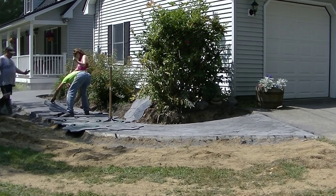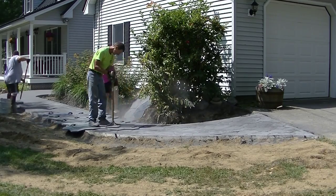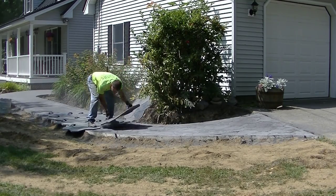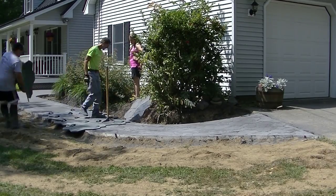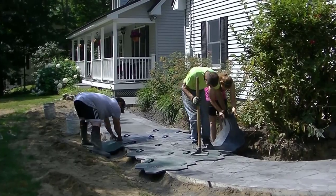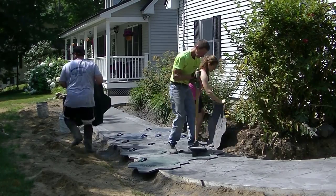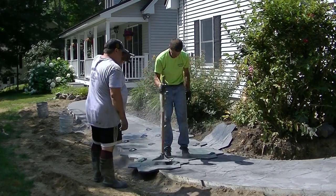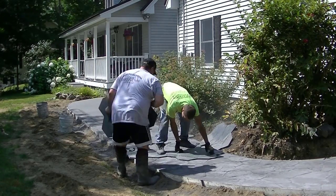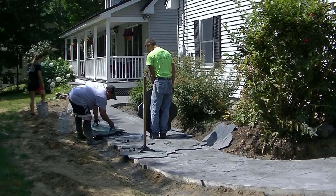You can see Abby there rolling the edge with the texture roller, getting good texture right along the edge. Sometimes when you tamp the stamp right next to the form board, the form holds the stamp from sinking fully into the concrete, so you don't get quite as good texture right next to it — that's why we like to roll that texture on there first.